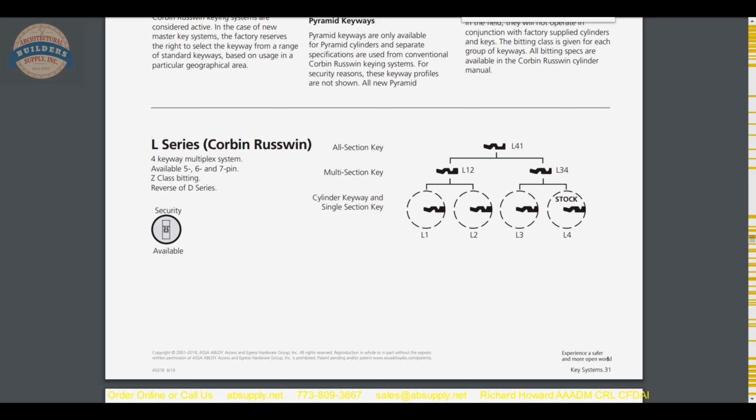But nickel silver, there'll be a brass plating over it. And the brass plating is actually nice because it looks like a brass key, except that it has the advantages of being more durable, nickel silver. And if you're a locksmith, you like a brass-plated nickel silver key blank because you can file the top of the blade down so that you can reveal the silver underneath. And the brass being there also helps you determine, the point I'm trying to make is, through the process of impressioning or working with cylinders and key blanks, a nickel silver yet brass plated can be advantageous.